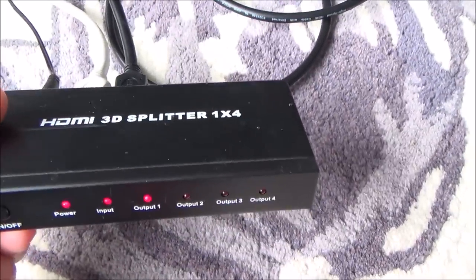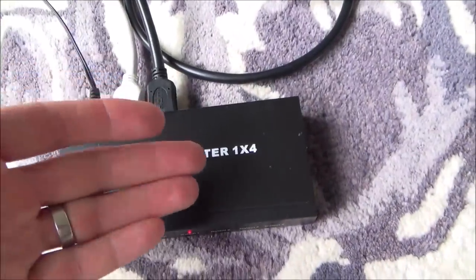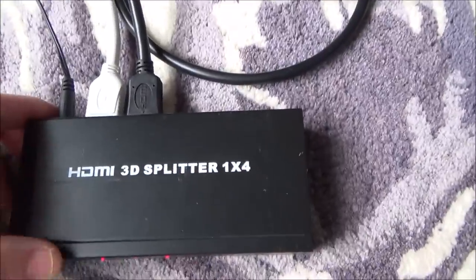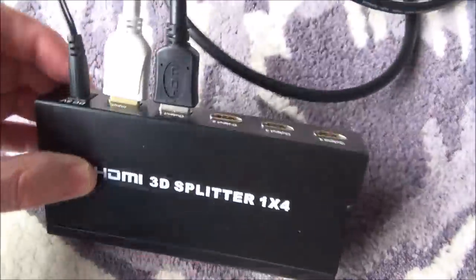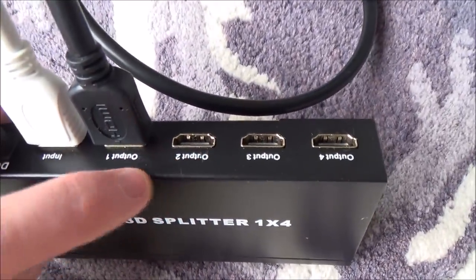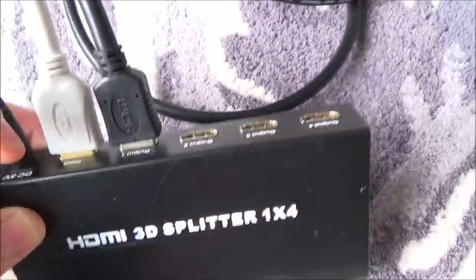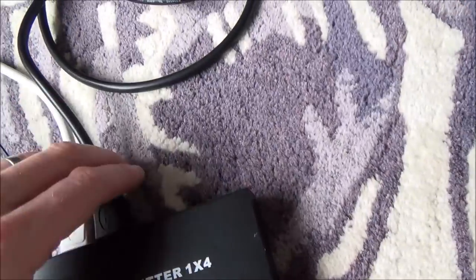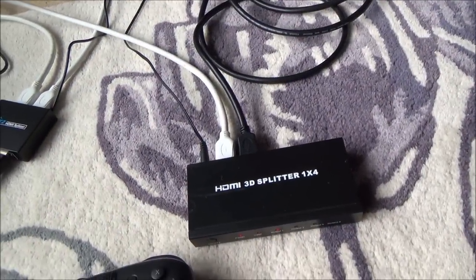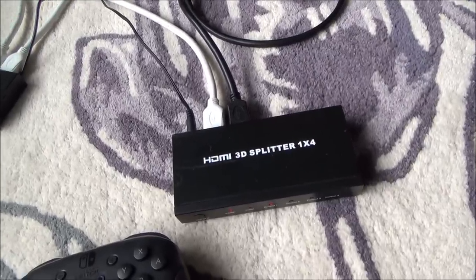These are not expensive. I got this quite a few years ago for £30; I believe they're as cheap as £20 now, or you can get 4K versions for between £20 and £30. Whatever signal goes into the input it will just mirror onto the other outputs. This is a 1-in-4-out; you can get a 1-in-8-out — obviously they're more expensive. If you've got a lot of money to spend you can get fancy HDMI matrices, which are much more intelligent and support numerous inputs to numerous outputs at the same time.